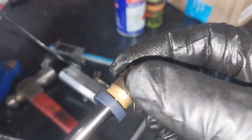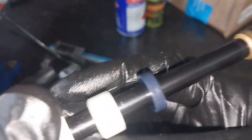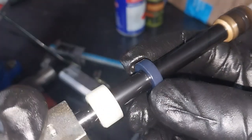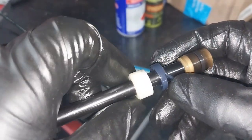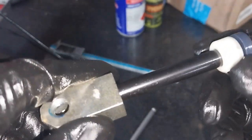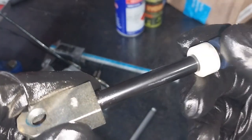As I said before, we don't touch these seals. This is the only thing that does all the work — that's just the support and keeps the dust out. This one's not bad, but the other seal has actually failed and that's probably why it's been leaking oil. So we'll drill these, press these out, knock that out, push that out, put a new one of these in, put a new one of these in. Then we'll think about what we're going to do here.